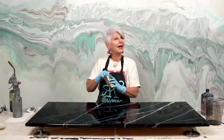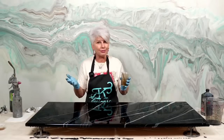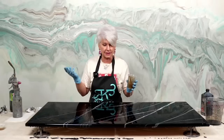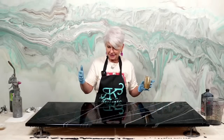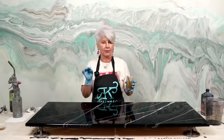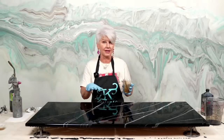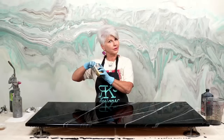How long do you wait for the alcohol to disperse before you torch? I just kind of look at it — depending on temperature, it's literally 15 seconds if it's hot, maybe 20 seconds if it's fairly cool. Even if you accidentally torch a little early and it flames with Stone Coat Countertop on a black finish, it's not going to be a problem. But on a white finish it can cause the epoxy to turn yellow, so be very careful.